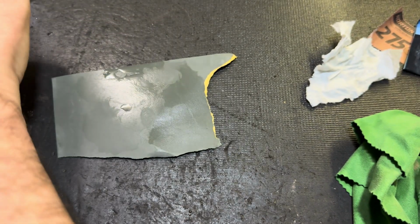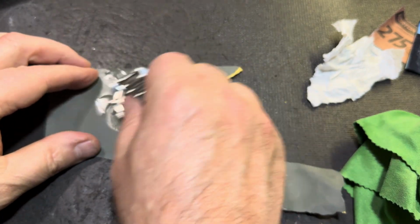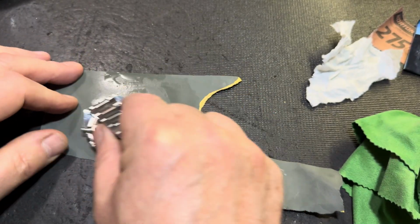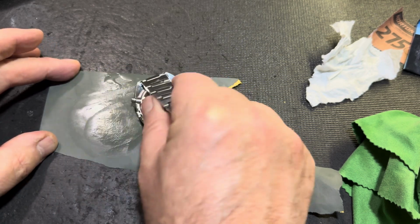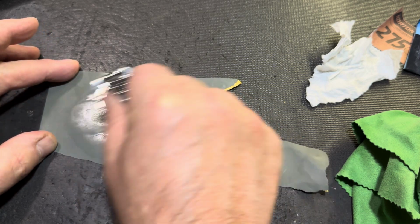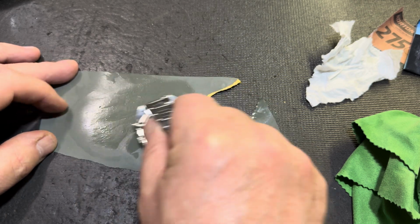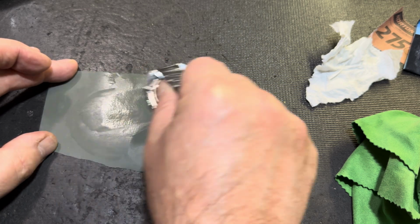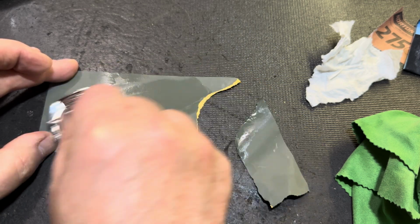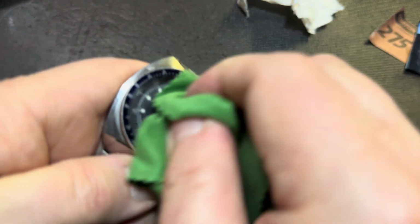Okay, so I'm just about done with the 2000. I was continuing with the lap sanding, or they call it lapping anyway, when you're pushing against a surface and using your hand pressure against it like this. So this is what's referred to as lapping, by the way. I should have mentioned that earlier. Okay, so again, you can start a little bit heavier pressure and then go lighter, because again, what you want to do is get rid of all the little swirls and little marks, okay? So this is not quite buffing, obviously, but you're getting close now. So let's take a look and see what we got now with the 2000. Okay, I'm just gonna polish that off.